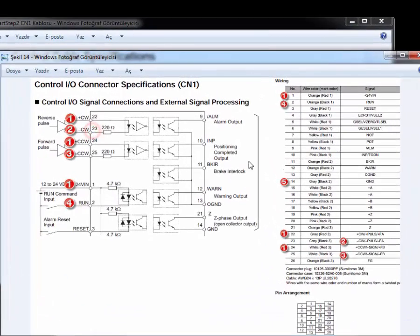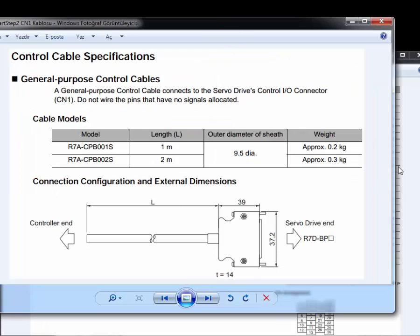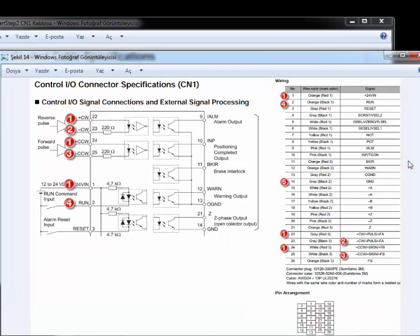Cable 23 corresponds to black with three dots on the gray cable. By the way, if you don't have this cable and want to make your own cable with solder, and if you bought the terminal socket, you can solder your connections according to these pin numbers. For example, if you want to solder your clockwise output, you should solder your cable to pin 23.